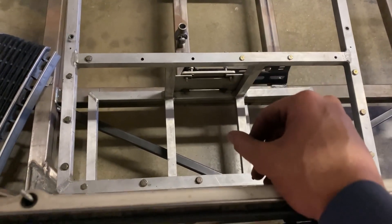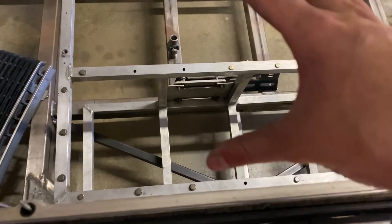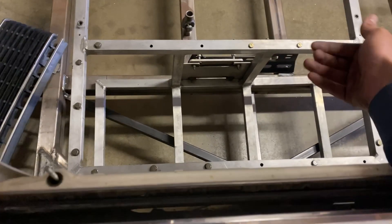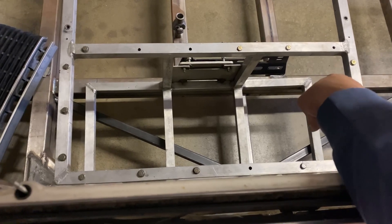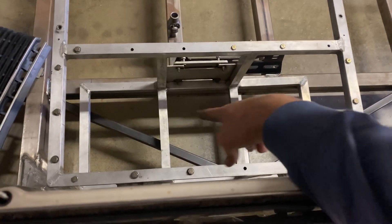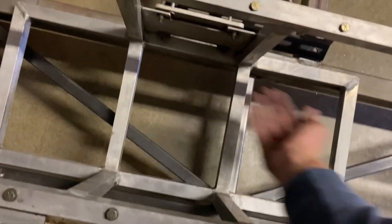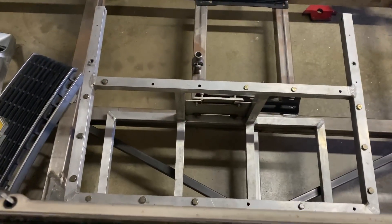I'm doing a completely different one, so I have to build the structure that goes around it — the upper part that has the flange where it bolts down, then the lower part, then build brackets to connect the cage to the frame on all four corners. I don't have to do bars on the inside because it'll just sit down on these floor bars and I'll have a big sheet of aluminum as the floor, so it'll be safe underneath. I'm gonna get to making the cage for my fuel cell.